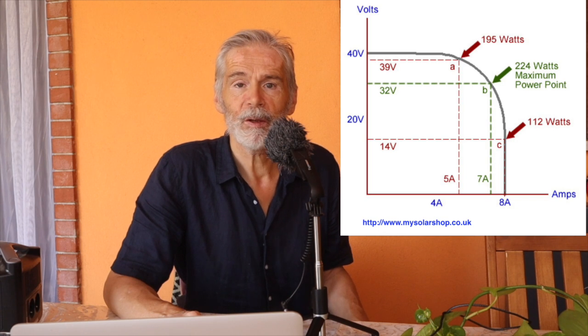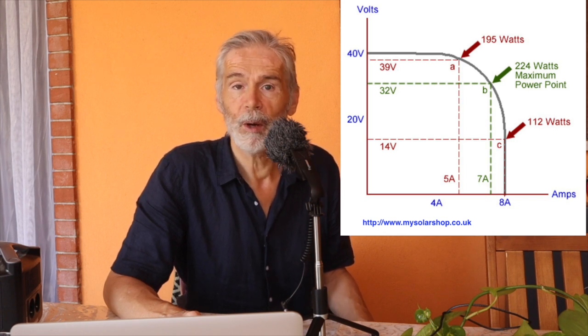I am sure that my friends will take a modern inverter-type fridge to replace the old one. They are well prepared to choose the right solar system of 700 watts. Now, one of the key features of most grid-tied solar panels is something called MPPT, or Maximum Power Point Tracker. Why do you need this? Solar panels don't always produce the same amount of power — they work differently depending on the amount of sunlight hitting the panels, and that changes during the day. The MPPT ensures that your solar panel is always working at its optimal power point, so that you always get the best performance from your panels.